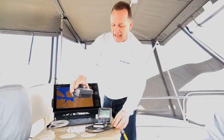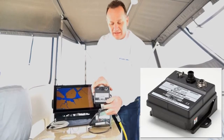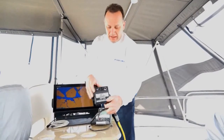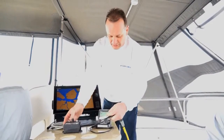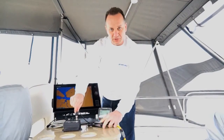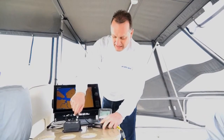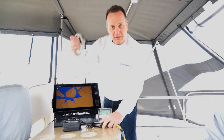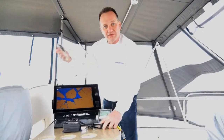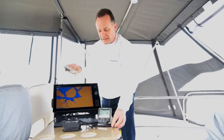What we'll do then is add our IPS interface — this is a Furuno IPS interface that you'll get when you buy the Volvo Penta NavPilot 700 system. What you'll do is take what's called this gateway and plug it into the CAN bus port on this little IPS computer. Once we do that, we plug that in and supply power from the ship's mains into this system and run this other cable over into the NavPilot 700 series processor, and that's the total installation — there's no more than that.